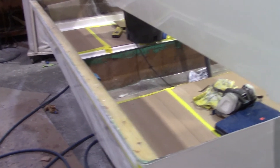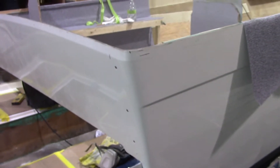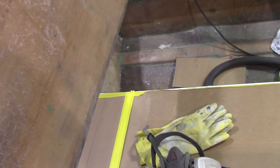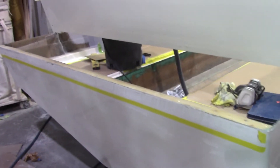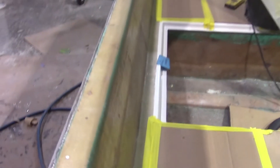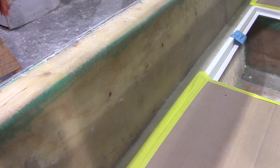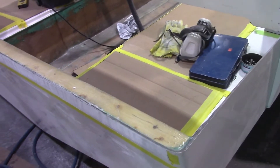Back to our boat — the first step was to lay up this hull. The wood we put in doesn't have to go all the way down; it ended just at the bottom, and the rest is just glass because we were cutting it out anyway. Then we lay up this transom hull piece where the motor is going to hang off, so we made it a lot thicker: two layers of three-quarter inch and then another layer of half inch — altogether with the glass it's just over two inches thick.